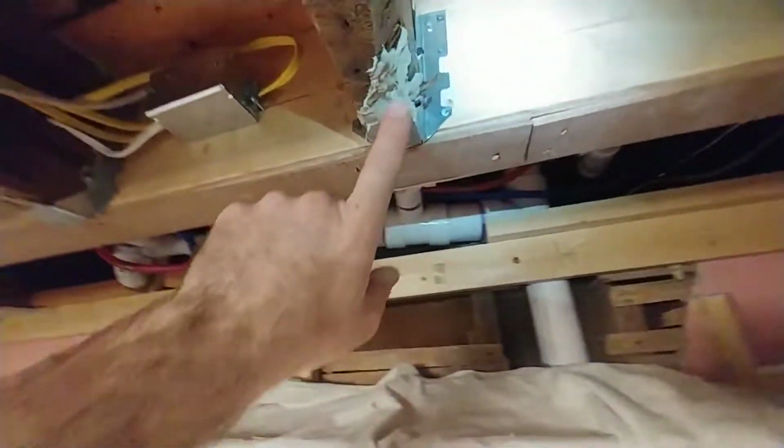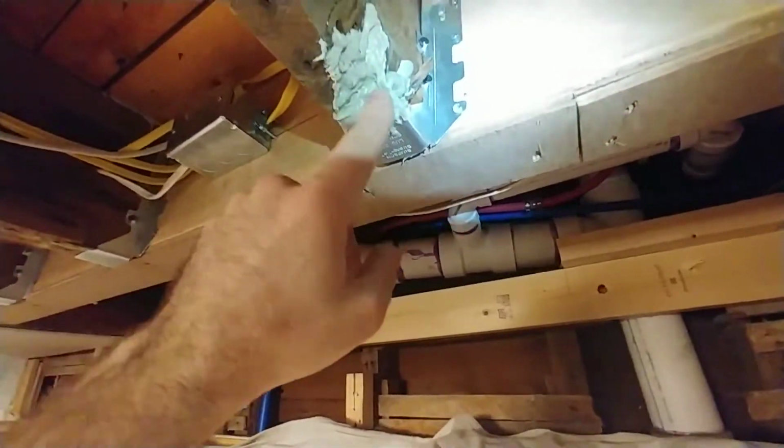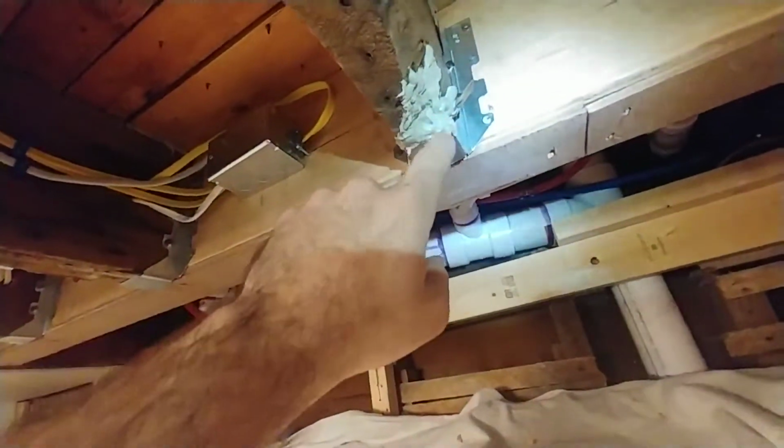And in this case we had a damaged location in this joist that had a big knot hole missing and stuff. It just made me feel a bit weird about setting such a little thin sliver end in. So once he was in the joist hanger, I just backfilled that area with construction adhesive, PL 400. And I did tack, where is it here? A few places all over, mostly over in there, but I filled in gaps with PL. I filled in some gaps over there with PL.